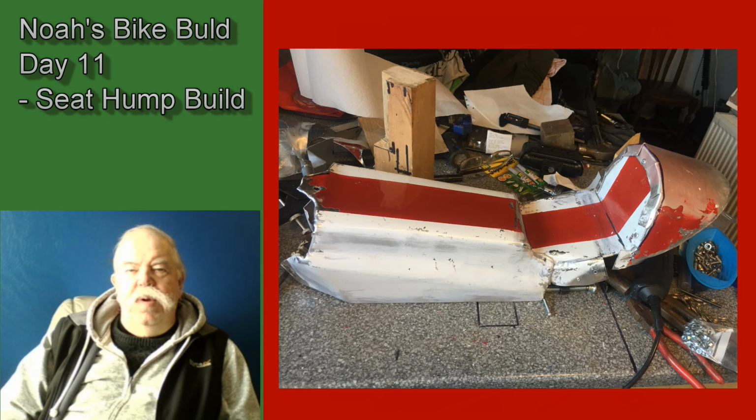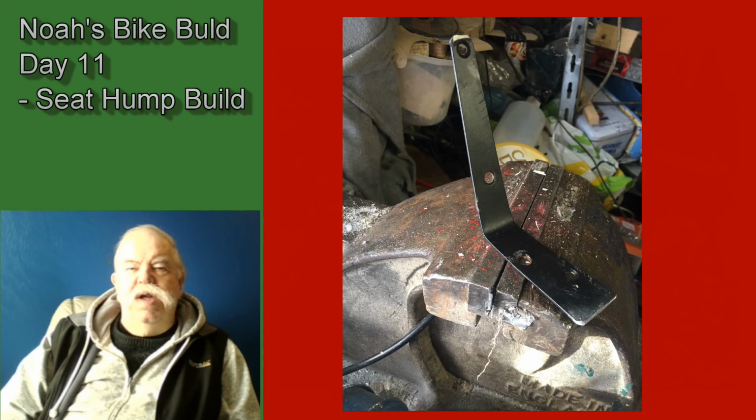Now the upright was still flexing at the bend with the seat base, and I've covered this in my description of it earlier, so it was time to start beefing up this structural rigidity. Back in the garage, found a suitable piece of steel. It was an old long hinge. Cut off the not needed section, put a bend in it approximately halfway along its length, and then tried it against the seat.